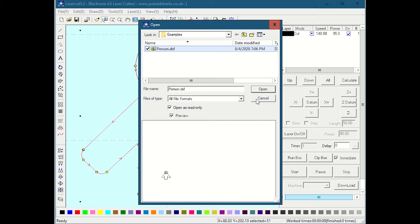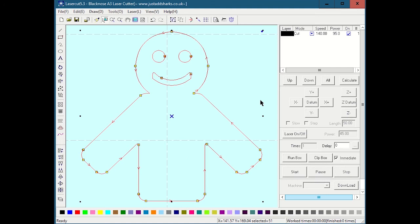That said, I don't know how much you've worked with DXF files, but sometimes newer formats can have weird types of geometries in them, which this program could have problems with. We don't see that too much, but you can always play around and save it. Sometimes you can save it in an older DXF format, or you can simplify it in certain ways. But that's all very dependent on how the DXF export in the program you're originating your artwork in works. So anyways, File, Open your DXF, and it should import it.